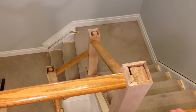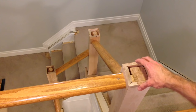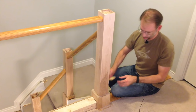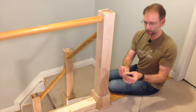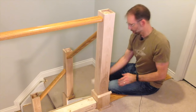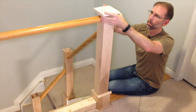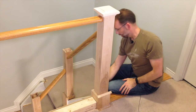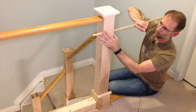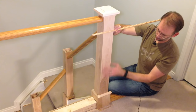Because I have an existing stairwell and needed to align these, I ended up having to plane a few of the pieces before I assembled the boxes to get them to align properly. To dress this up, I've got a few more pieces to add. This is cove molding, which goes on the base. I've also got a newel cap — I've purchased these pre-made, meant for a four-inch post. And then to dress up this flat area, I've got astragal molding that will go around here just to dress up that flat edge.